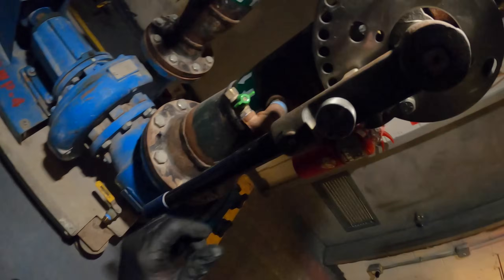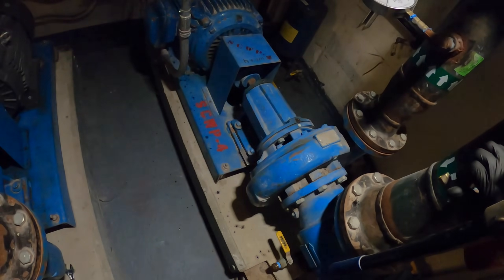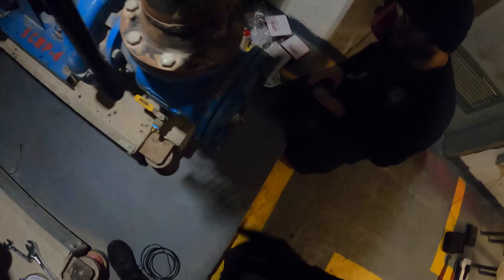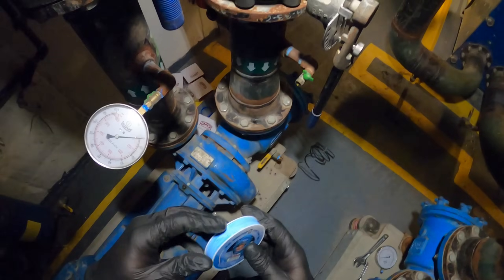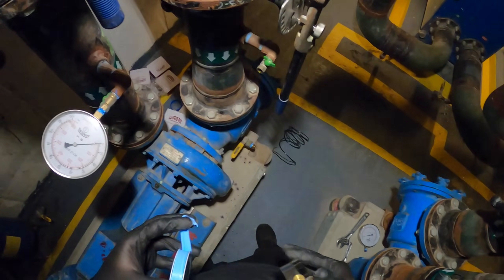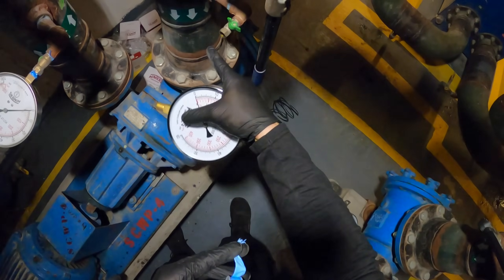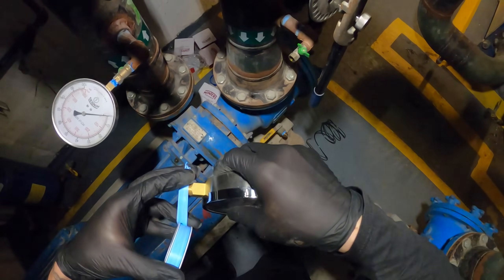Give it a little push — there might be nothing here. That was a little bit more than a push. We're going to need to clean that up. That thing was reading not too much. I'm using Blue Monster PTFE tape and you've got to put this on the right way. When you've got water squirting out of there like that and all that black stuff comes out, you're good — because you can clog up these little gauges here, and that's how things start to fail. Maintenance.